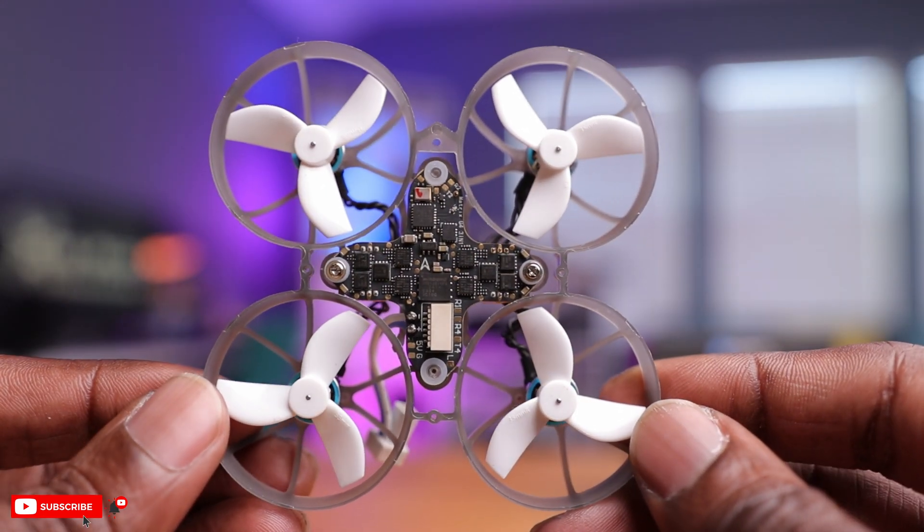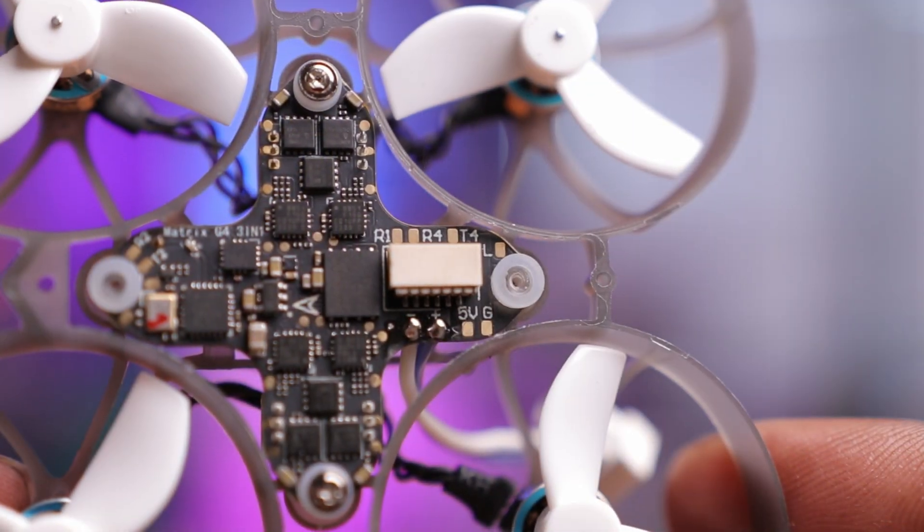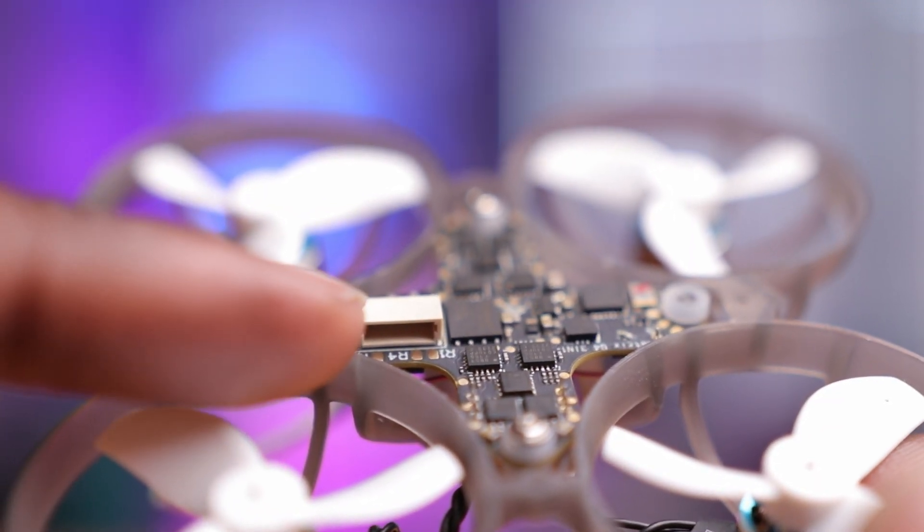I do have my 1S VTX here on my Pavo Femto — I'm just going to take it out of this canopy and transfer it to this drone. This is a pretty cool 2S drone in the same category as the Pavo Pico. The flight controller here is made specifically for the O3 and O4 system, which is pretty cool because those VTXs have a plug-and-play connector — you just plug it into the flight controller. That does increase the weight a little bit but eliminates the need to solder. We have that harness so you can just plug into the flight controller and the other end into the VTX. I'm going to install the O4 air unit in the canopy, attach it to this drone, and then take the Meteor 65 Pro O4 for a test flight.